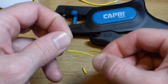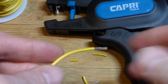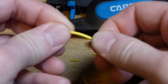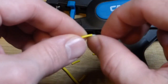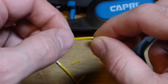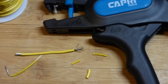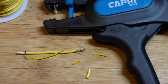This is solid wire — that's one solid metal piece — versus stranded, which is a bunch of little wires together. Stranded wire will bend without wearing out as quickly, whereas solid wire is made for having the wire in a fixed position. If it needs to move around a lot, stranded wire is the better choice. Also, the stranded wire here is 16 gauge, so it can handle more current than the 22 gauge wire — larger wire handles more current without getting as hot.